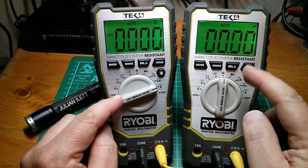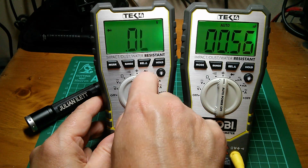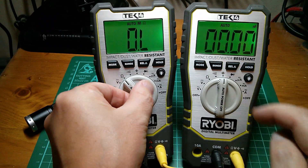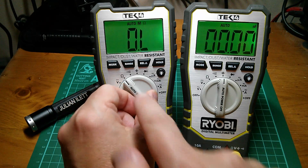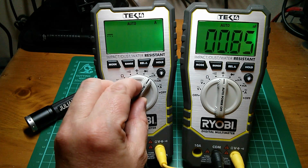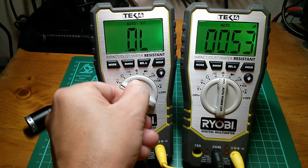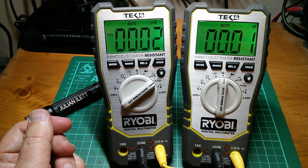Here's another one. When this meter is measuring capacitance and I flick through the ranges, it picks up some strange random capacitances which it then seems to just hold on to. I don't know whether it just gets a momentary capacitance and holds on to that until you drop out of those mid functions. If I flick that around, this just picks up a random 0.85 nanofarads - or 0.53 nanofarads. Just strange random capacitances it holds on to.